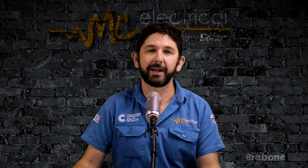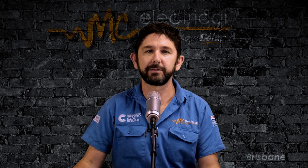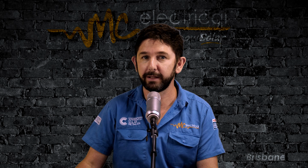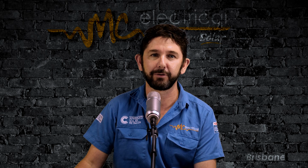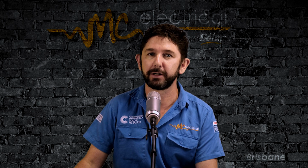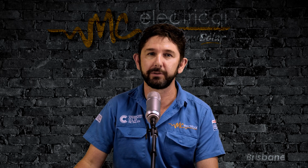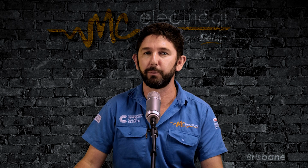But getting back to the inflexible 5 kilowatt SolPlanet inverter that we currently have available. Let's say your house roofline is big and simple and an inflexible SolPlanet inverter will just do the job. Would I recommend SolPlanet then? No. At the time of recording, SolPlanet monitoring platform does not allow consumption monitoring. If you don't know what consumption monitoring is, you should. A consumption monitor just allows you to see how much electricity you're using, whether it be power from the grid or power from the solar. I think a consumption monitor should be considered essential when you install solar.